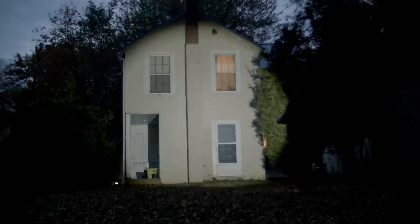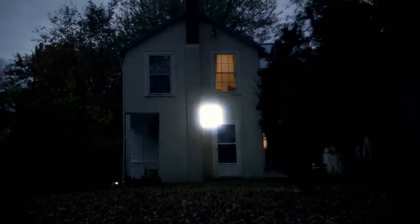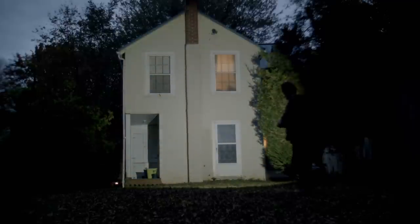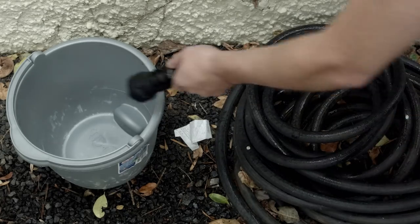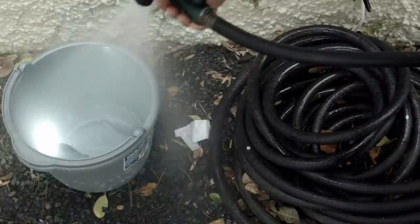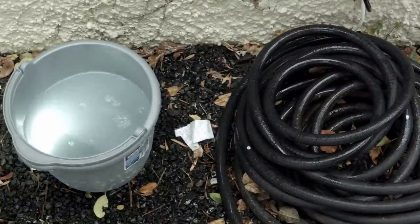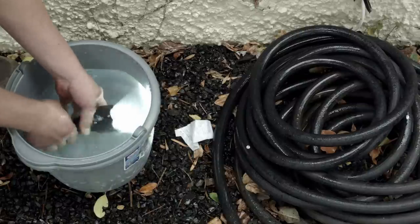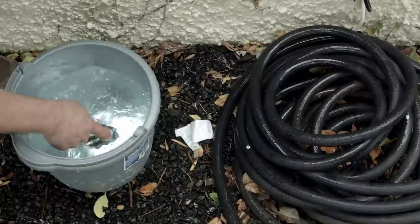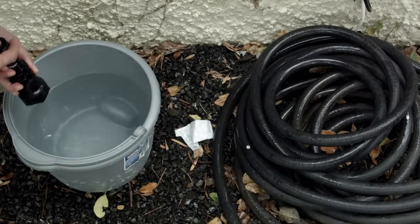Because of the aspheric lens on the front of the light, it's covered in a type 3 anodization and made from heavy duty aircraft grade aluminum. It zooms by twisting the rear of the light, which allows it to be more water resistant than other zooming lights because of the double o-rings along the zoom tube. So you're good to use it in the rain because of its IPX8 standard. I did a short test with the hose, clicking the button, zooming and unzooming the light several times underwater, and upon taking the light apart found the interior of the battery tube bone dry and no moisture inside the head. So it was a success.